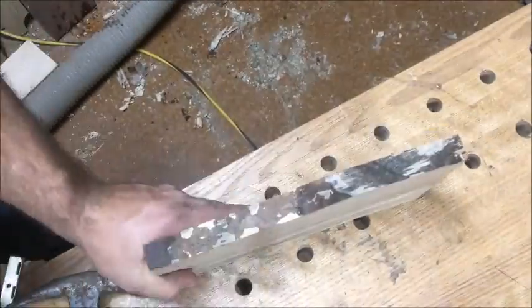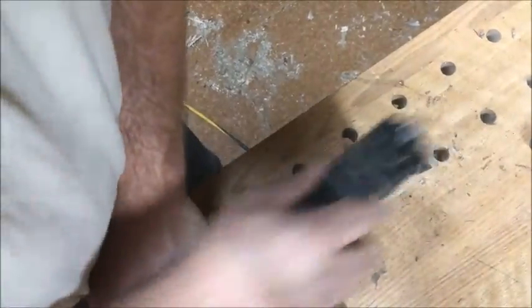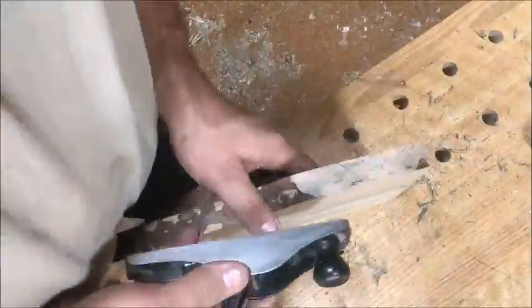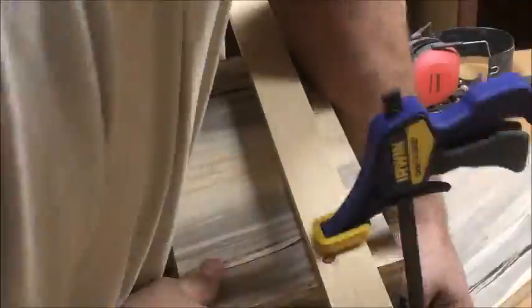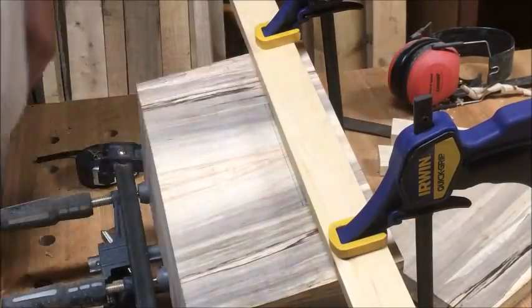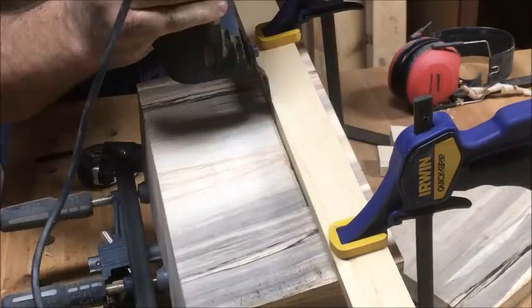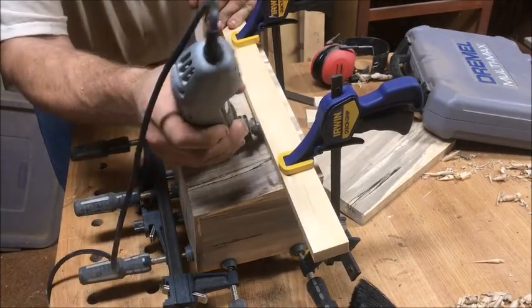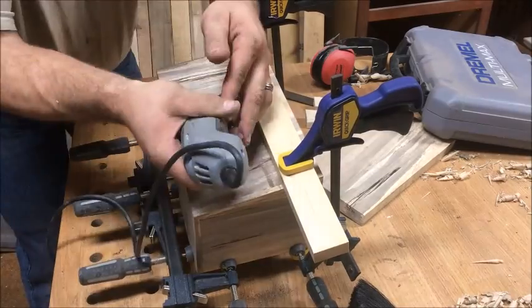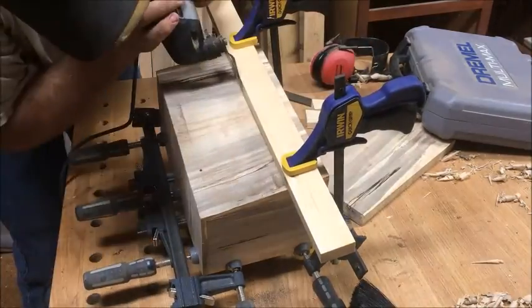And then the back panel here is what's going to be mounted to the wall, and the box is going to hinge open on. I'm leaving a live edge on the top of that. So this is the end of where a branch came out, so I'm just cleaning that up a bit. Then going over here, clamping a small piece of pine in onto the top so that I can use the saw here to cut the actual slot for the suggestion papers to drop into.